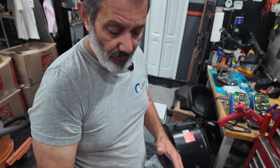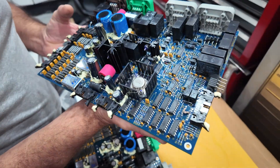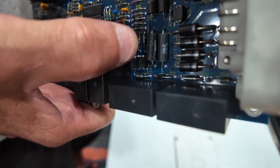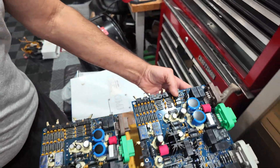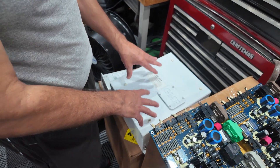We go through the components and a lot of times the capacitors take the brunt — they go bad. Capacitors don't last forever; they only have a shelf life of maybe 10 to 20 years max. We'll pull the capacitors out and double check them. On this one here, the customer states he doesn't have any shift, and this little component here took the brunt of it — that's what's not giving him any shift. We'll see how much bench time we have and replace this piece, then try to fix this board. If we can fix it, we'll give him the option of repair time cost or sell him one that's already operational.